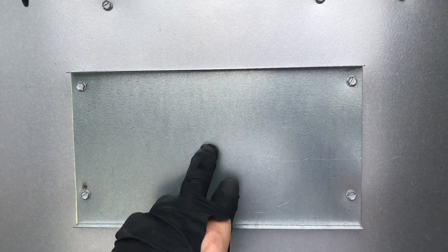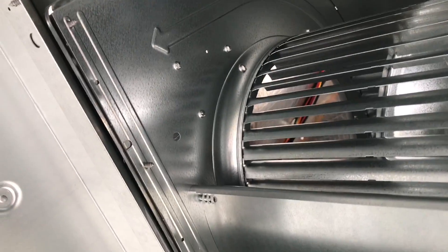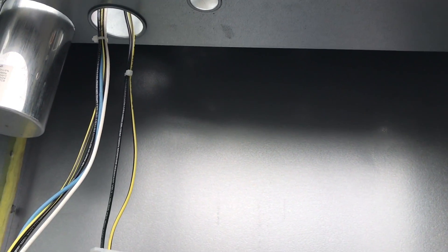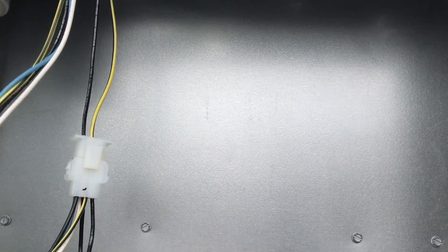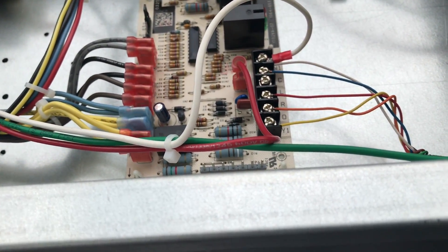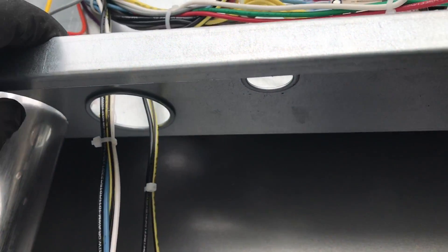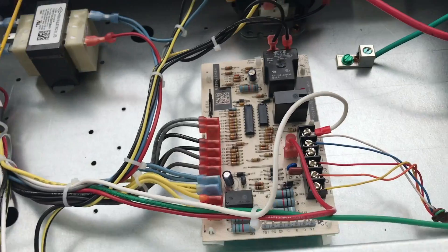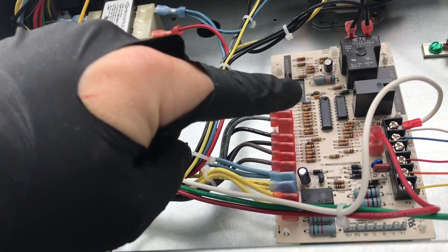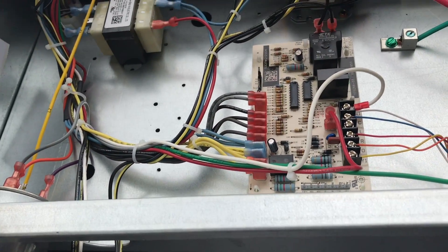Next time, going through that electric heat strip panel would be a lot easier — it'll be directly in the path of the blower and you don't have to run the wires all crazy. Looks like this unit only has one transformer. With a Nest thermostat, if you hook it up to R and C it's going to cause issues. What you can do is plug it directly into the transformer — that won't cause any issues; just put a little splitter with spade connectors. Or you can put in another transformer, which is probably what I'm going to do. But if you're in a pinch, hook it directly to the transformer before the board and you shouldn't have too many issues. I always try to put in a separate transformer, so let's go get one.